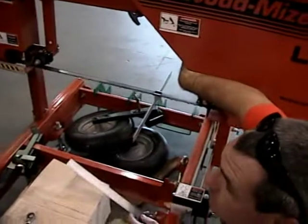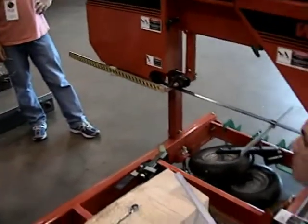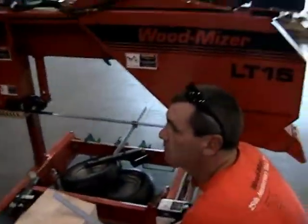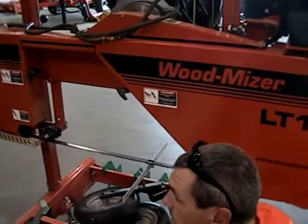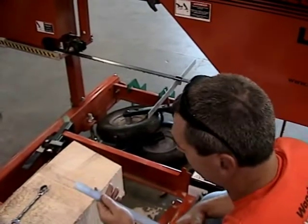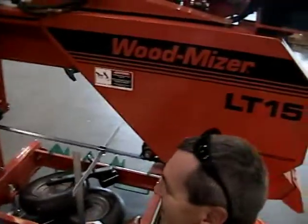Yeah. Well, like I typically do, I'll put a straight edge across the bed rails, and then just measure it statically. You can do it that way, too. Yeah, absolutely. So I don't have to move the head any chance. That's actually a good idea. Yeah, because those LT70s are pretty hard to push the head sometimes. Yeah, that's a great way to do it. Thanks. I'll put that in my notes.